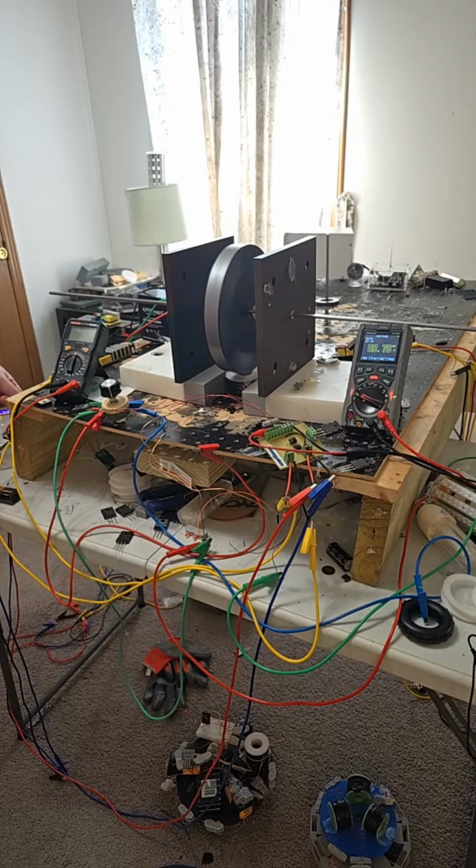Alright, so the signal generator is still on. We're at 12 volts, and you draw more amperage with the frequency being so high. So we're at 0.8, 800 milliamps. So that might not be a good way to do this. You get 5 more volts for virtually 500 milliamps more energy spent. That's not a deal. That is bad. Still cool though. Signal generator does increase the voltage output.